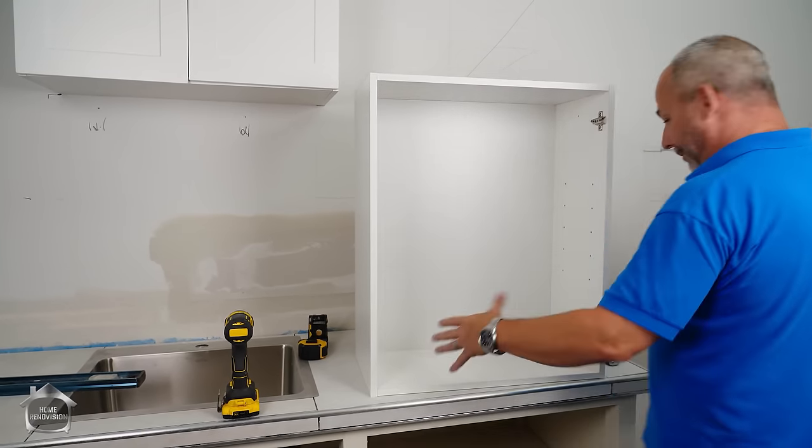All right, now, just a trick. I'm lucky because a 2x4 is exactly the gap that I want. I can just set this on there and same thing, I can start a little pre-drill. The only flexibility I have with this system is I can put the screw in the middle of the slot, because this is an adjustable height channel. I'm going to go with the middle for the screws because I'm installing three doors over a length on concrete. I put them all at the very top at the same distance and use the 2x4. I might find something that's like, wow, that looks ugly. I've got to make an adjustment because the floor could be dipping. So I'm leaving myself a little bit of room here for adjustment.